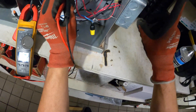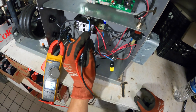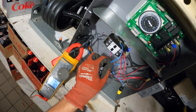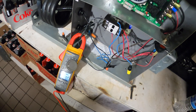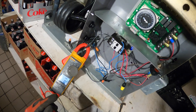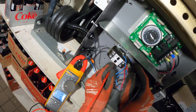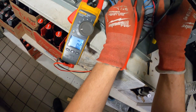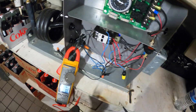That switch is backwards — down position and we've got power, 208. This is the coil for the contactor. The thermostat should be energizing that. Just to make sure we don't have power across — we don't. So something is holding out our control circuit.